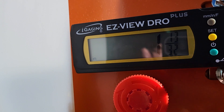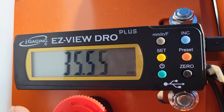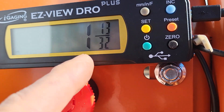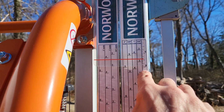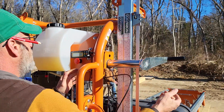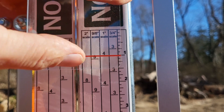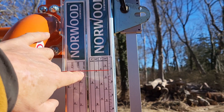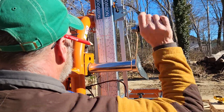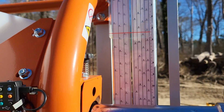It'll also read in metric. You'll notice it reads the same measure as the outside scale. You have to go through a preset procedure to set this to read the same as what your blade is off the bunks. If I go down to one inch, here we're at one inch on the DRO and one inch on the scale. By mounting it out here, we can still use the lumber scale on the left and haven't modified anything on the mill. If I crank it up to five — it's at five. I can go to five and a quarter — it's five and a quarter.